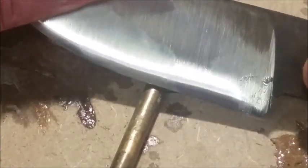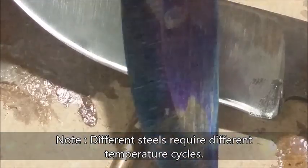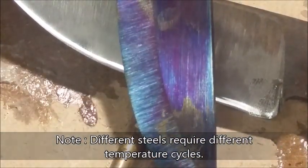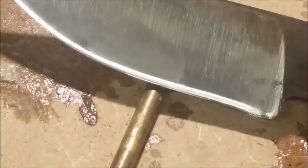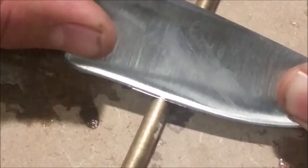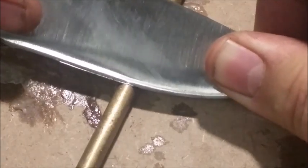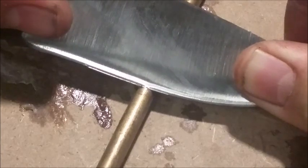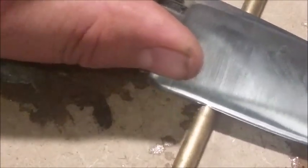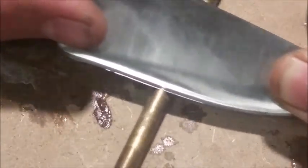For 52100, at approximately 250 degrees Celsius, until it becomes purple like this — that is a very good color for your bearing steel. Let me just check the other side. You can see just flexing the other way around. You can hear there's no cracking — look at the way it bends, see that little flex there in the middle. Cracks are very obvious — you'll hear it clicking as all the pieces chip out. But this is flexing very nicely.